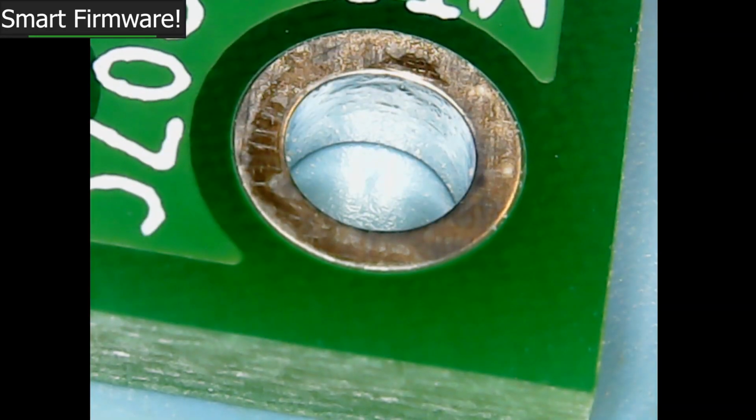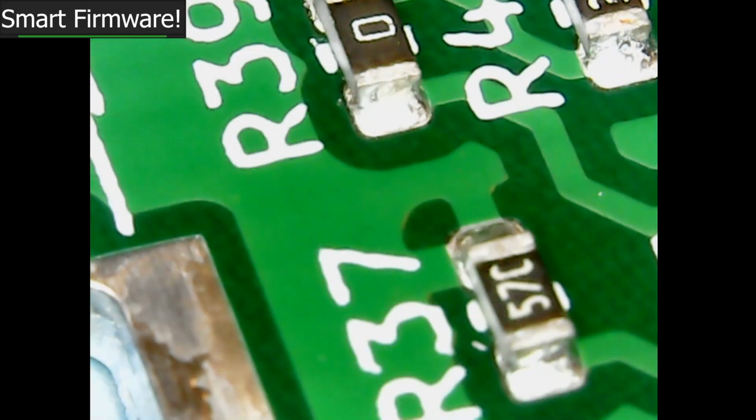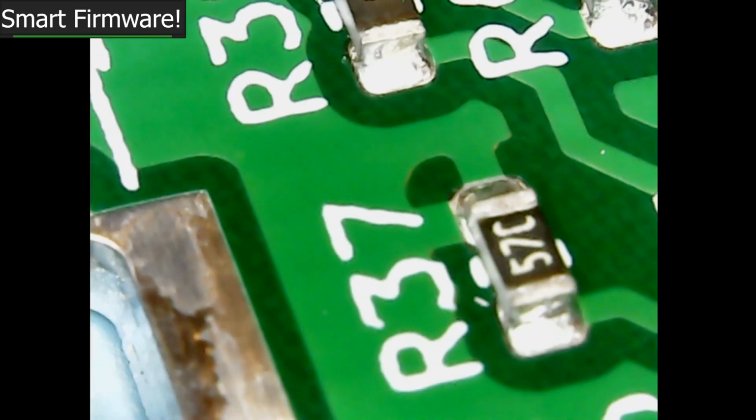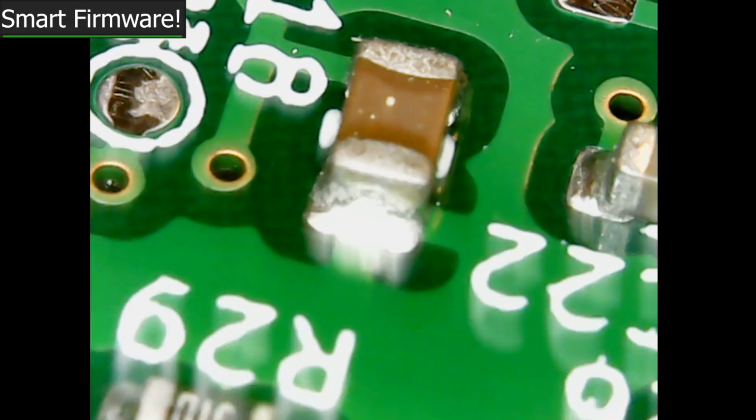If the software has already tried to turn off the heating element, but it hasn't turned off, what's it going to do? Try to turn it off again? That's where this comes in. For example, if the clock generation circuitry in our microcontroller in that 3D printer were to fail, it would just stay wherever it is. It wouldn't change state ever again. And that would be kind of a problem.